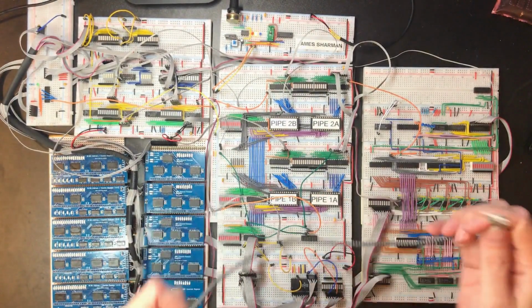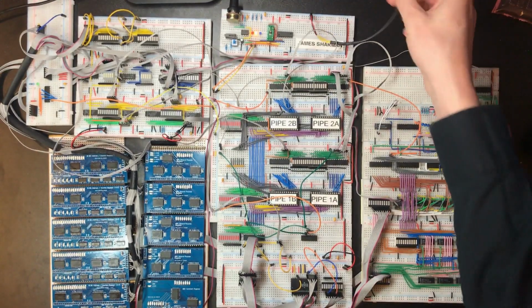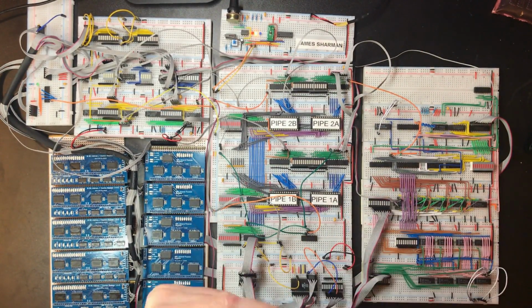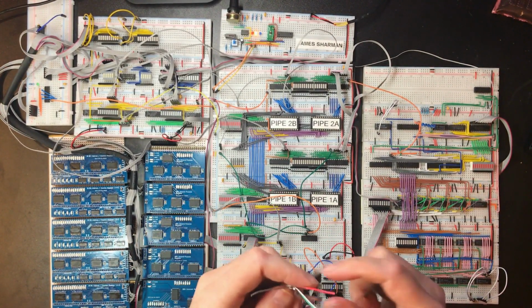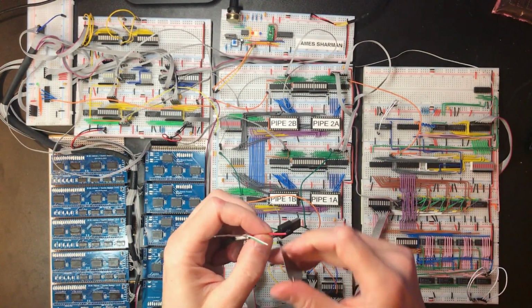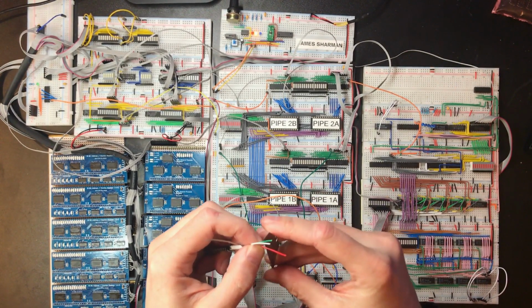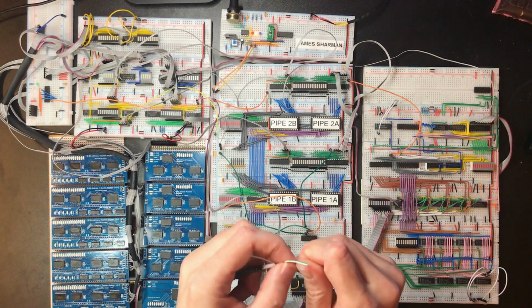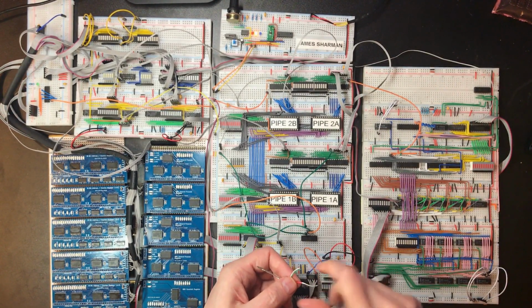Right, I've got a mini USB cable here I'm prepared to sacrifice. Let's see what it's got inside. That's how I made my original power cable, but this was a random cheap one. I'm guessing this external wire is ground. And this power line does look a lot stronger than the data lines, which was not the case in that one. I purchased this as a fast charge capable cable, which I was hoping meant it could take a bit more current. Yes, there is a lot more conductor in here.